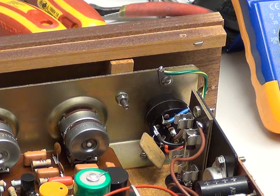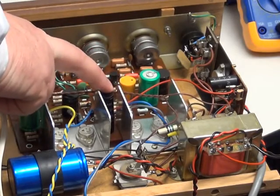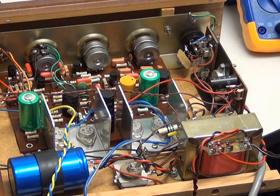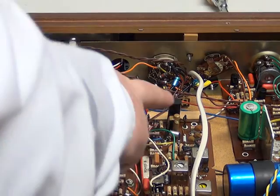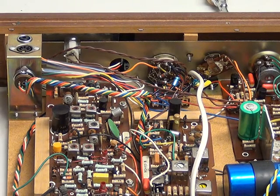So we're going to change that and change the capacitors. The capacitors we're going to start with — that one on the voltage stabiliser board, the black one there. There's a black one there and a few more — I'll give you the numbers later. There's one there, and we'll change that green one as well. And then on the decoder board — the stereo decoder board's got one which needs to go there. And then on the radio tuner board we've got that black one, and we'll change that one for good luck as well. But those black ones are a particular make — Calin or something like that — they're awful, they never were that good.